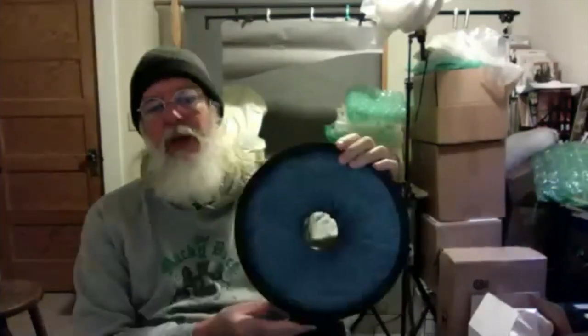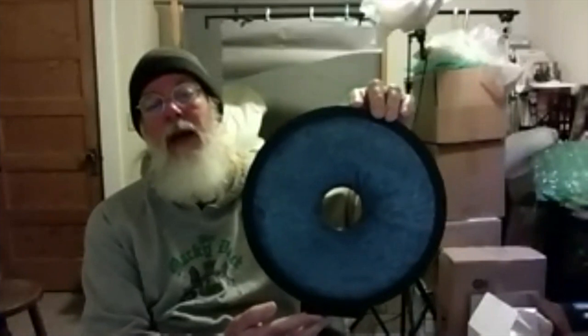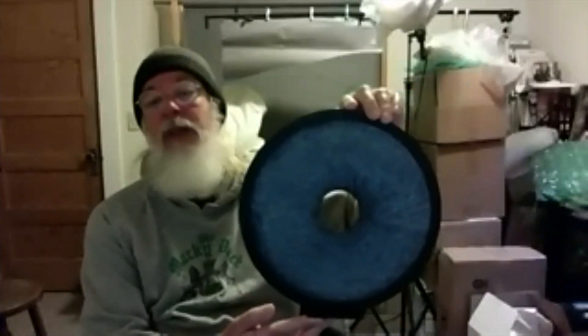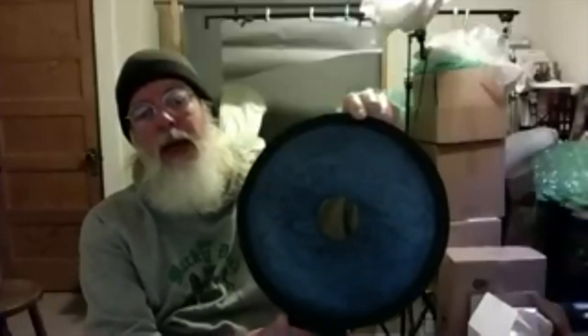Good morning, everybody, from Astoria, Oregon. Hello, Rick. This is called Portal. We have an arts organization about an hour drive from here, hour and a half, called the Hoffman Center for the Arts. They put out a call for their January color show, which is black and blue. Those are the only two colors, and you had to use both of them. This is Western red cedar, about 11.5 inches in diameter, turned on my 7750, and then I do a lot of texturing. I like to abrade back the softwood, and I do that either with wire brushes on the flex shaft or, in this case, the 3M radial mops, 36, 50, and 80 grit, and then black leather dye.